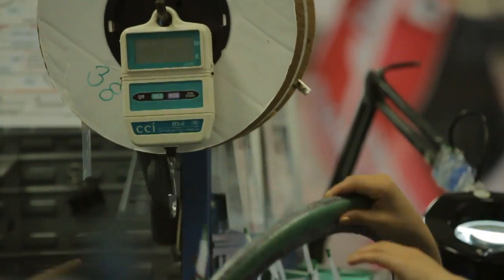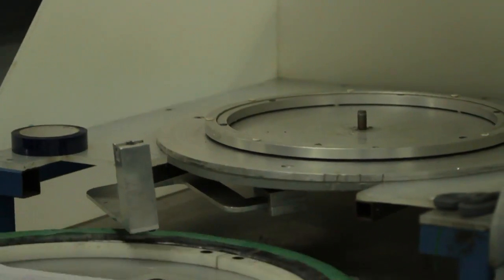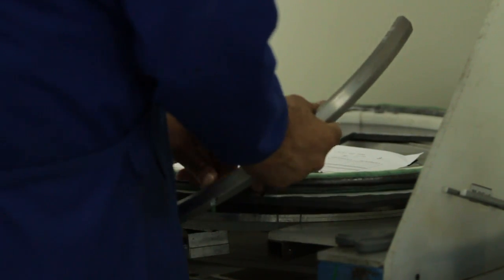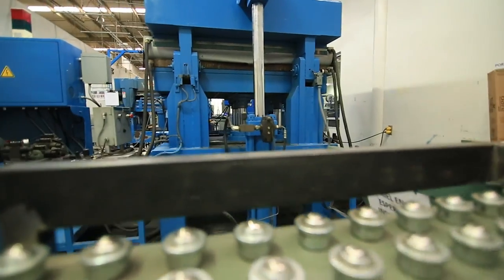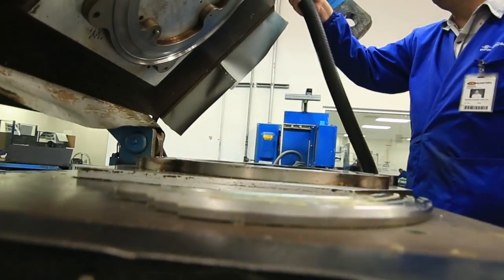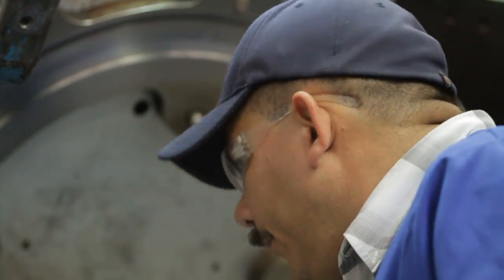The pre-form is then weighed and recorded — just one step of many in the quality control process. The tire bed insert is attached with the bladder passing through it and the honey dipper attached to the bladder, and now the pre-form is ready to be passed to the molding room. These rooms are kept separate to keep contaminants between the two areas down. Step one in the molding room is to clean the press — first with a brush, then with a vacuum, then with a rag and chemicals — to make sure no contaminants get on the pre-form.